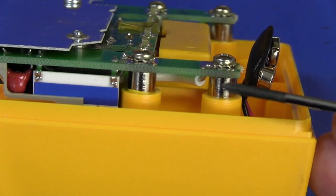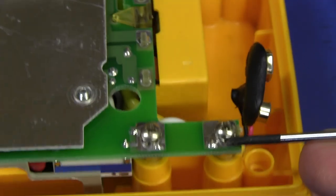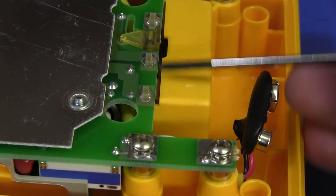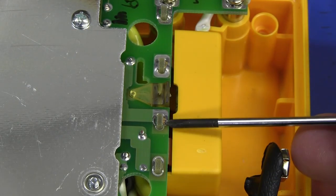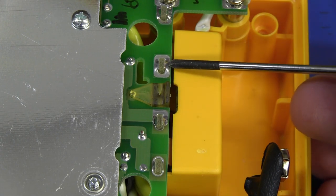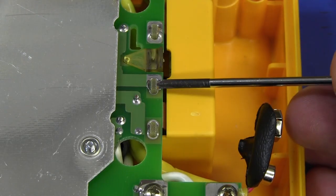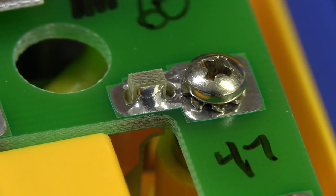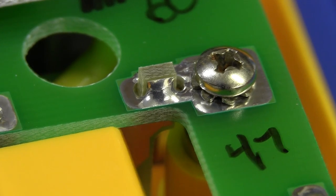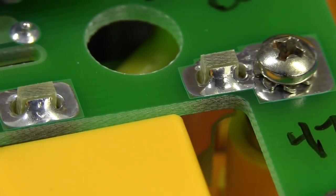Look at all that shielding. You'll notice the fairly deep ridges around there that go right into the top part of the case, and there's good blast protection — if this thing goes kaboom inside, it's not going to escape very easily with those high walls and the O-ring. Very safe meter. The input jacks here are solid metal posts with shake-proof washers, screwed directly into the PCB. The fuse PCB is on a vertical riser board soldered directly onto the main board — the board has cutouts like little tabs which feed through and are soldered directly. The soldering quality is absolutely first class.